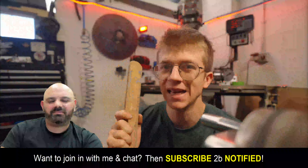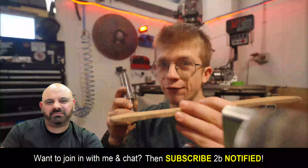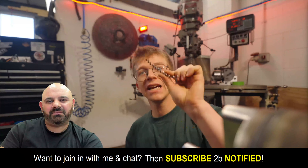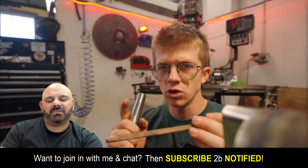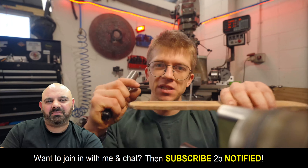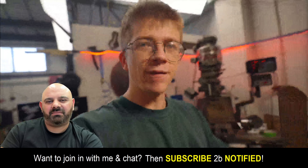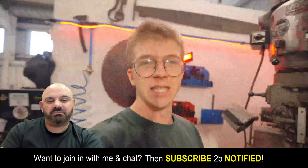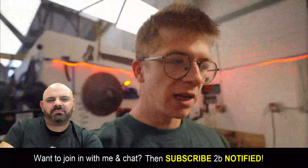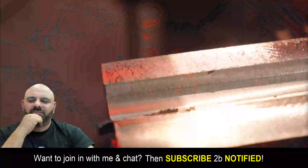When the steel chip goes off it takes some of the heat from the equation with it — the titanium chip, not so much. With those suggestions in mind, we're going to try a lower relative RPM than we would with steel. It also suggested heavy depths of cut, as well as making sure the work piece is well supported because titanium is quite flexy. As a result of that, I can't just clamp this in the vice and expect it to work — I think I need to make soft jaws. These will hopefully help increase the rigidity of the work holding.